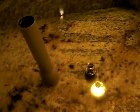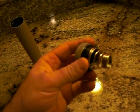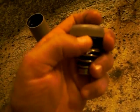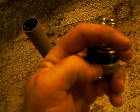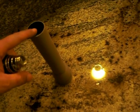So anyway, thanks. Another thing that I wanted to mention about all the flashlights, anytime you're Duracoating a flashlight, and I've run into this, I think, on every one that I've done so far, and I haven't mentioned it in any other video. I don't know if the camera's going to be able to pick it up, but when you break these things down into different parts when you're doing a flashlight, be real careful, because a lot of times, like the metal in here, the threading, and sometimes, like for instance on this one, I got the Duracoat just over the lip where my thumb is, just over the lip right here, and it had a coating of Duracoat, and it wasn't allowing that right there where my thumb is to contact the rim of the light right here.